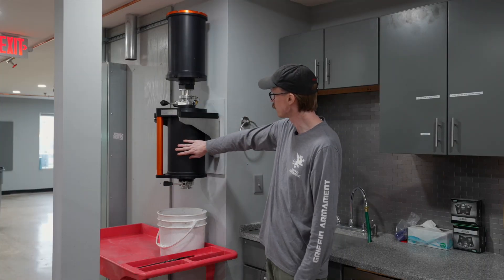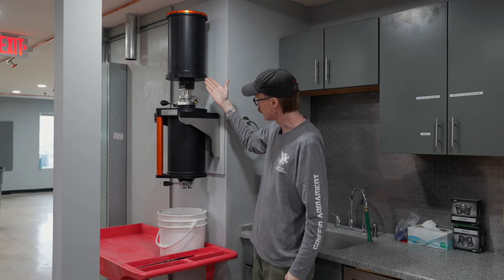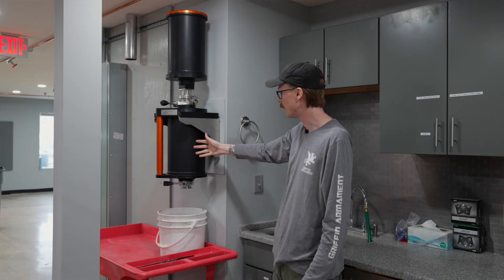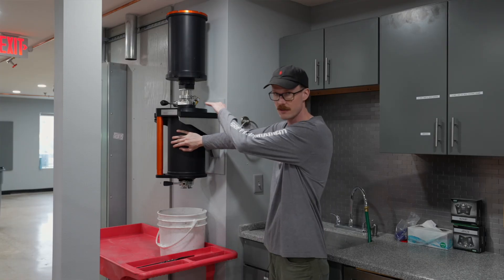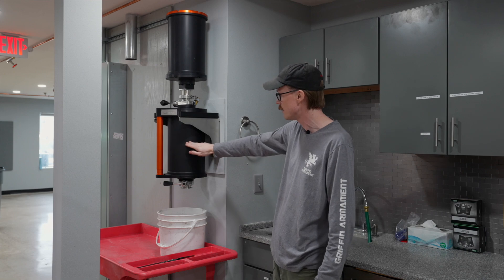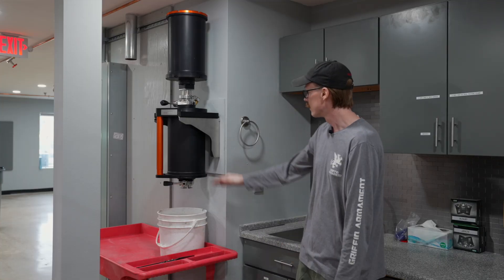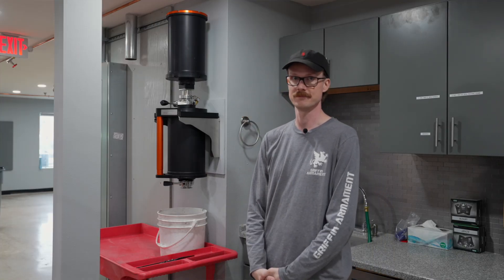For cleaning filters, dirty filters come over to the sink. We fill up an extra canister with water, open the valve to let water in, and fill it up to passivate the filters and all the metal powder collected inside — it's never been exposed to oxygen and we want to keep it that way. We let it sit for about 20 minutes for full passivation of all the metal powder, then drain it into buckets for proper disposal. Once drained, the filter inside gets taken out, replaced, and the old filter gets cut up and disposed of accordingly. The inerting water goes to a recycling tote handled by an industrial recycler.